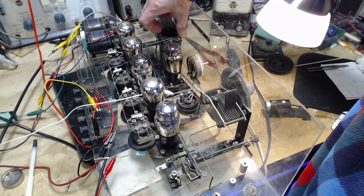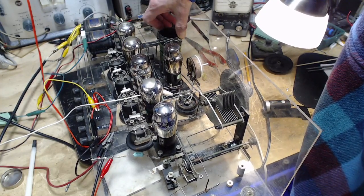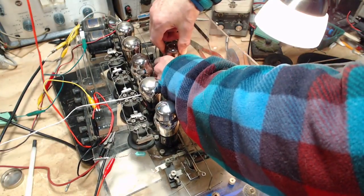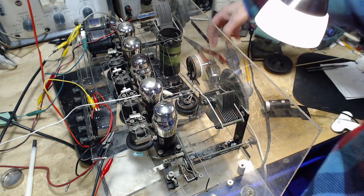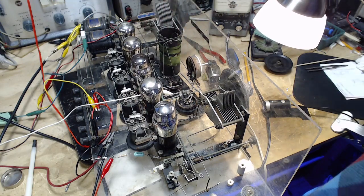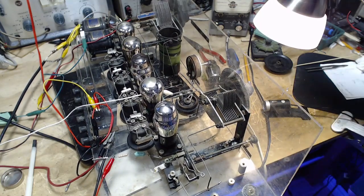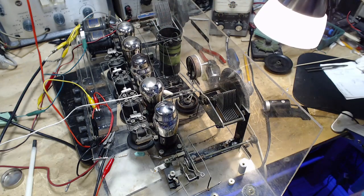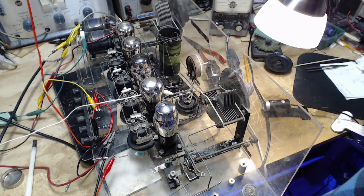What is going on with this coil? What condition is it in? Yeah, let's take a look at that. I'm going to pull this tube out. So some of the windings are definitely loose on the outside here. The curious thing is the coil that's suspended inside here. So it looks like it's a 3-coil arrangement. One coil, 2 coils, and then a third one inside.